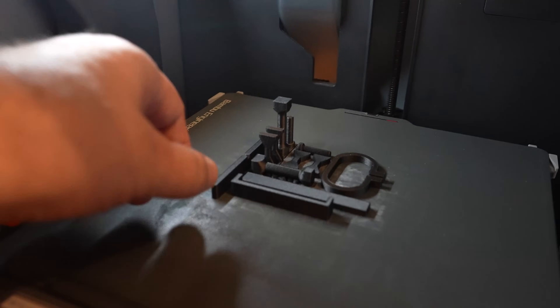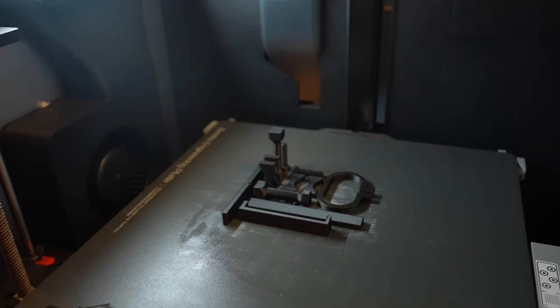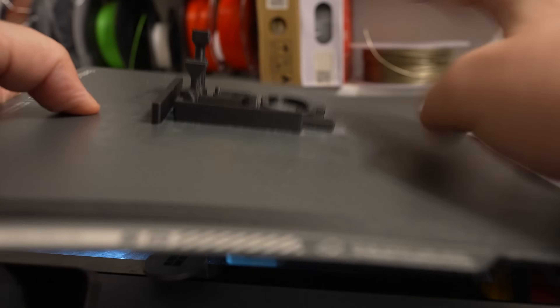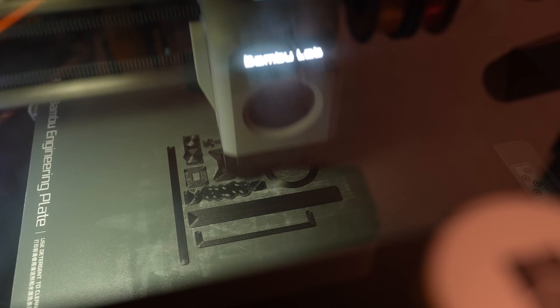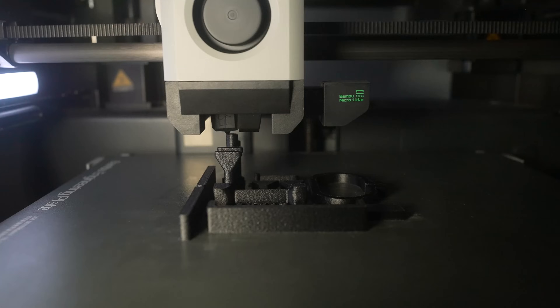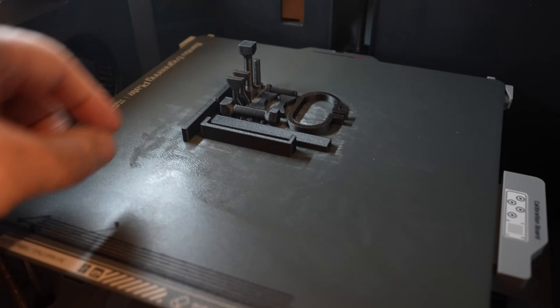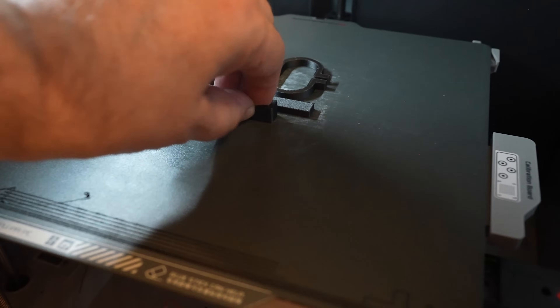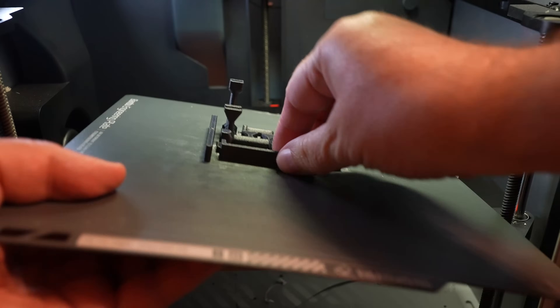Last few vertically printed test objects — it looks quite fast. Bed adhesion check: I hope it's not too good. The build plate cools down. This is the group for the annealing. Now this is PA6 CF and I am using exactly the same settings as with the PA12. It is printing the last vertically printed test object — the printing looks nice. Only later I will check the surface quality. Bed adhesion test — still very good. And when the bed cools down: perfect.